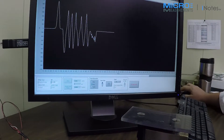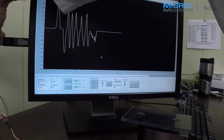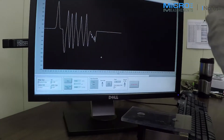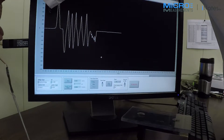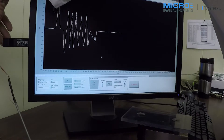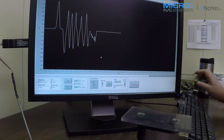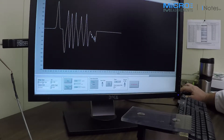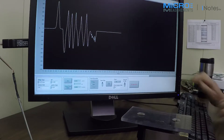Let me stop this. I'm going to show you now how to measure force with this MM01. I'm going to go ahead and connect the load cell. Now this load cell is a full bridge device, and we're going to set it up to measure in units of pounds force. So we're going to go here and change our bridge type to full bridge. We're going to set some custom units, which the software permits, and I'm going to change this to LBF, or pounds force.